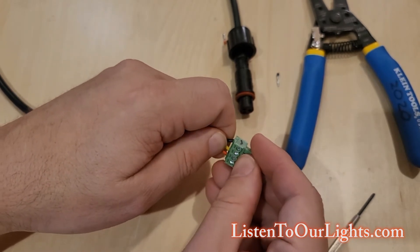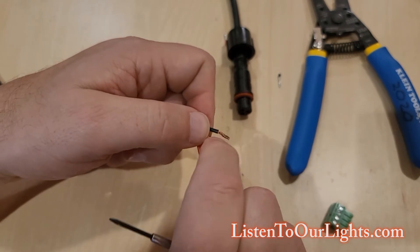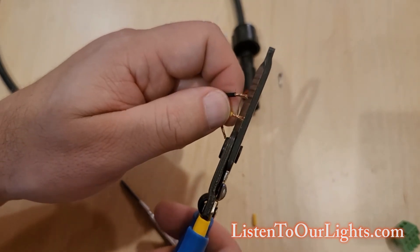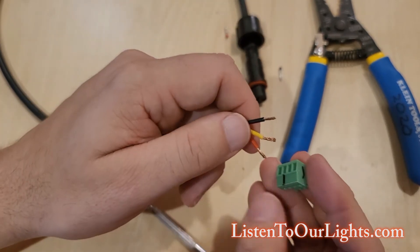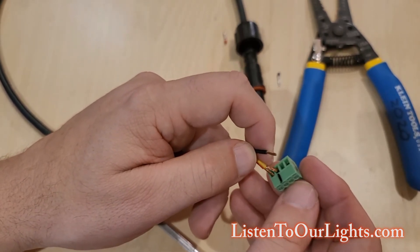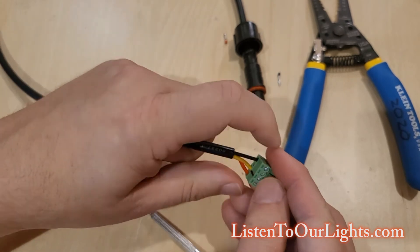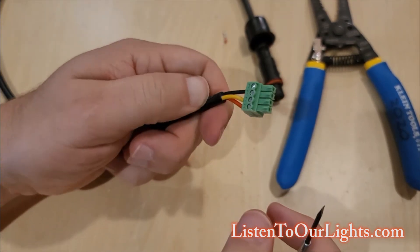I want to put them in in such a way that I don't have any copper exposed. These are feeling just a little long, especially that V minus, so I'm going to trim it back just a teeny, tiny smidge. And then even less of a smidge on the data. It doesn't have to be perfect, but the better quality you do, the less likely you're going to have a problem. There goes the V plus. Now the data — to me it kind of feels like I'm walking them in. Just give them a little wiggle, not pushing hard, just a little wiggle so they kind of get in there on their own. They're all in there, so I'm applying some pressure, then I get in there with a screwdriver — right turn to lock them down. All in there, nice and seated.